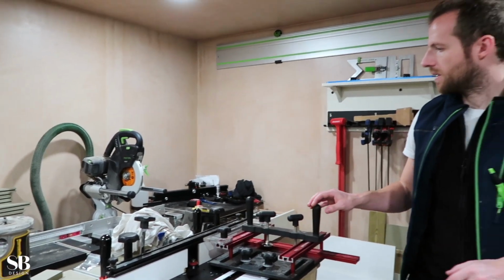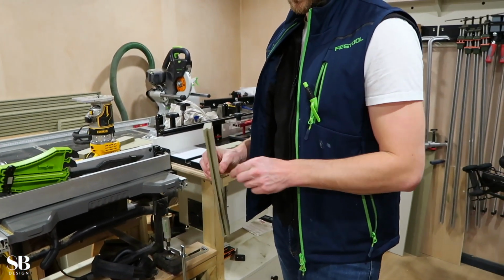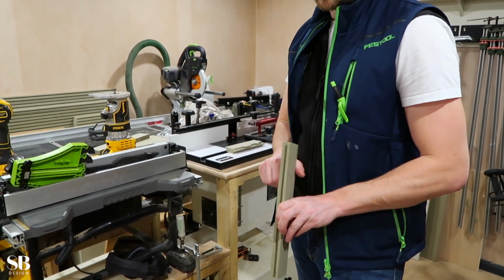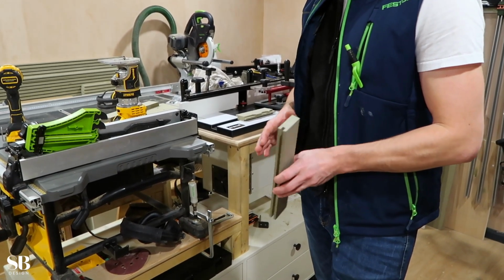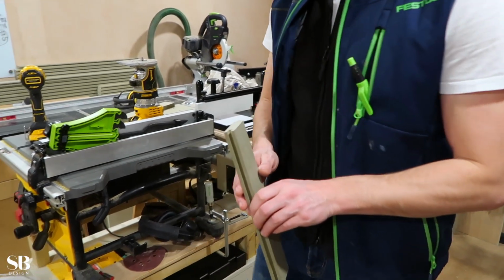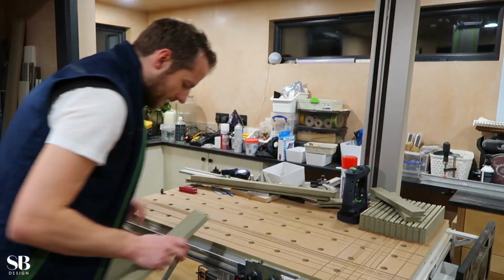And then the other element, which we'll show you next time, is if you cut. So typically with a shaker, the panel, as you can imagine, sits in the middle of here, so that you get that rebate effect on both sides. So if you open a door, you can see the rebate. With it being a drawer front, because this front has to screw onto the drawer, you don't want that shallow void, so you actually want a solid non-shaker on the back of it. So what that means is, I then have to do another step.